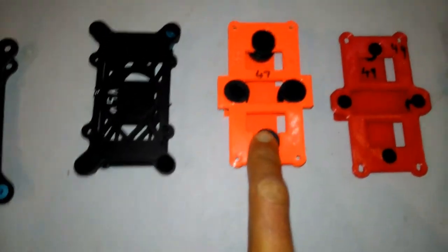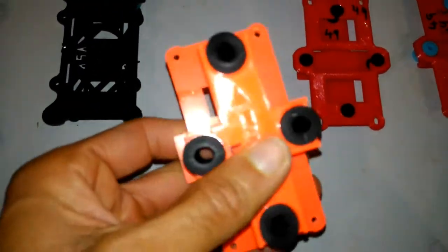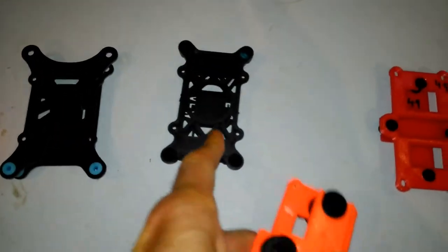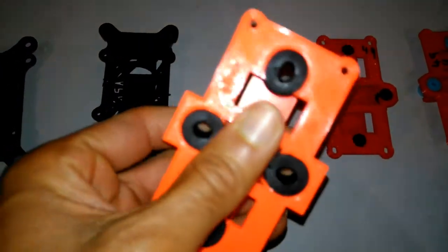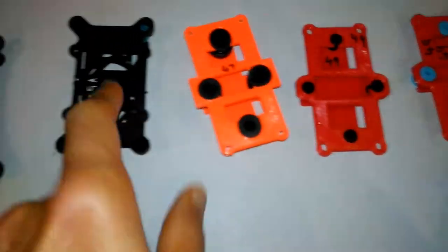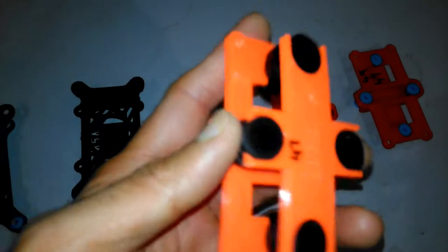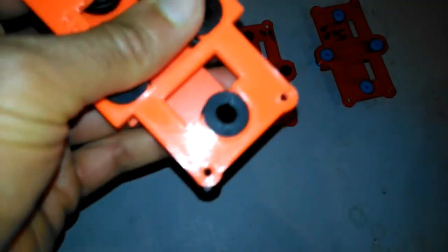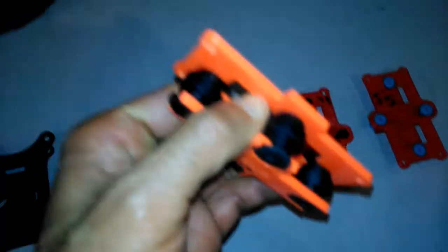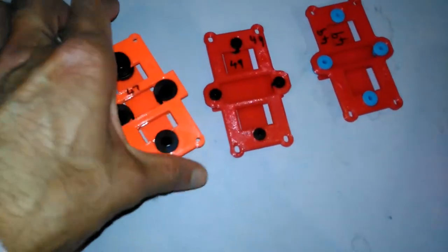That's the reason why I had to design a new part. Then came this one — the next part I designed. This was slightly heavier, and one of the problems was that the vibration wasn't as good. The main reason was because of these rubber grommets — they were too big, they were too hard. Although they hold in place — if I try and pull this it's very difficult — there is still vibration.